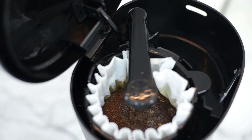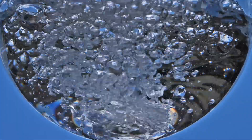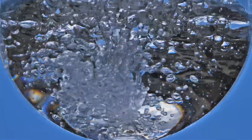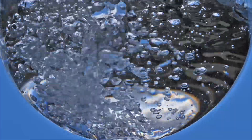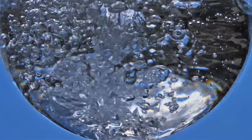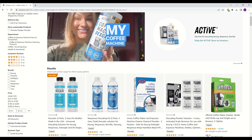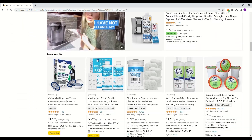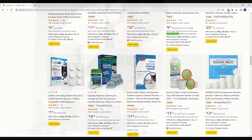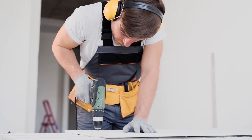Second, the strong squirt is a hard one to fix. The main cause of those squirts is hard water — some minerals can block the shower head, making it hard for the water to flow easily. You can use vinegar to clear this, or some cleaning tabs they sell. If after this you're still struggling, I suggest drilling the shower head to make the holes bigger, thus lowering the pressure.